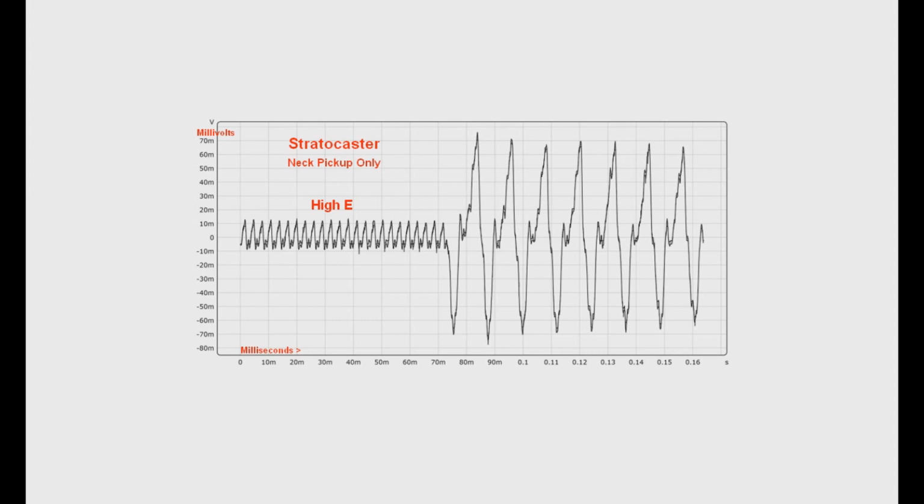To test this, if you mute your guitar and then engage the boost pedal and it doesn't pop, but with the boost disabled and you begin to strum and as you strum you engage the boost pedal and it does pop, then this may be the issue.